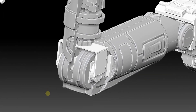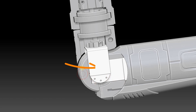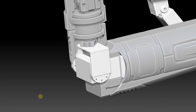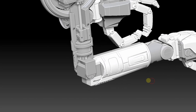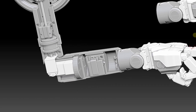Now we're moving on to the elbow. The elbow is composed of a single servo — the 60 kilogram-centimeter servo I've been using for the head and neck. Hopefully it's strong enough to lift the lower arm. It's attached by its frame to the D-shaft coming from the top and then attached to the forearm.